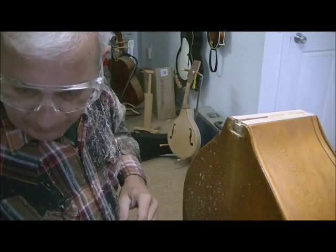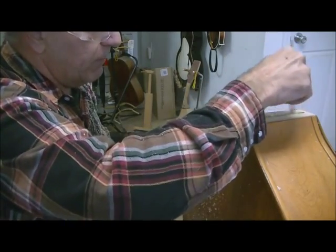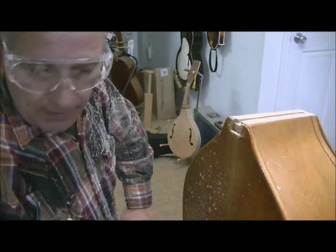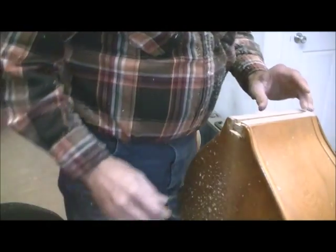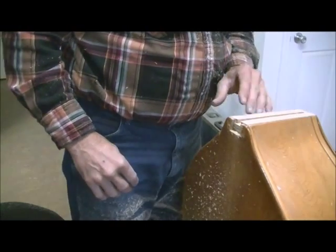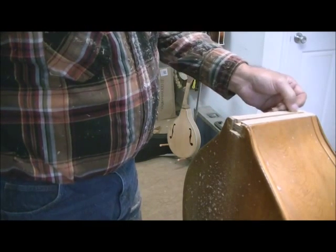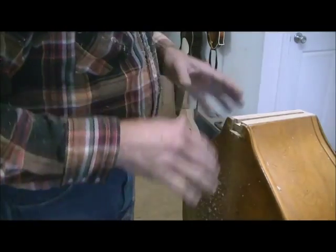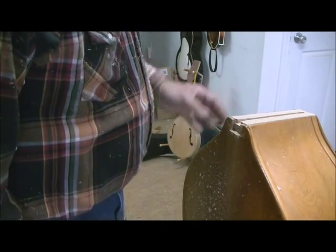I decided to use the dovetailing bit to do the hogging out here. The dovetailing bit looks like it's going to match the angle of the dovetail almost perfectly, which is amazing. I've taken about a 3/8-inch deep cut right down the center. I'm not trying to get close to my lines yet — I'll probably stay at least an eighth to a sixteenth away from them, because I'm a little concerned about the dovetail bit cutting in deeper than intended. It'll be trial and error.